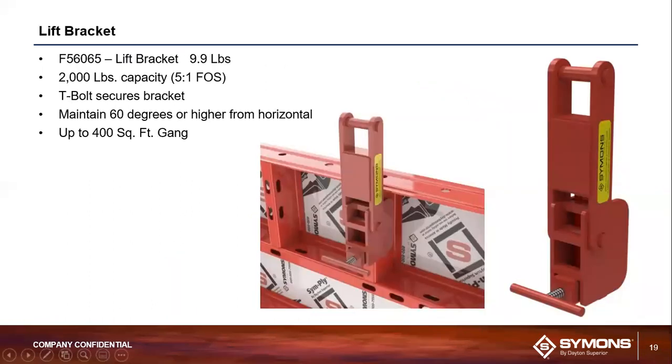Okay, so next up is our lifting bracket. This was engineered and designed to straddle, as you can see on that larger picture there, the vertical cross members of the panel. It connects with that T-spring bolt that you can see towards the bottom of the component part in those images. It weighs a little under 10 pounds, and it has a 2,000-pound safe working load and a 5-to-1 factor of safety. With this part, 2 lifting brackets can support lifting about 400 square feet of SymPly gang at the job site, okay?